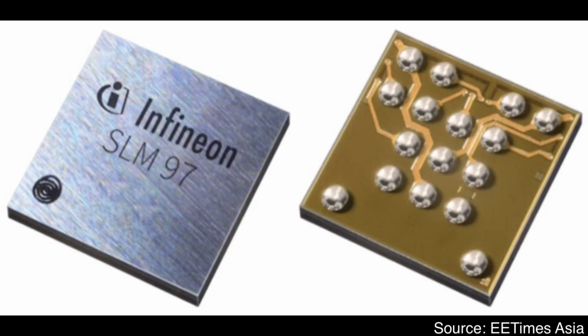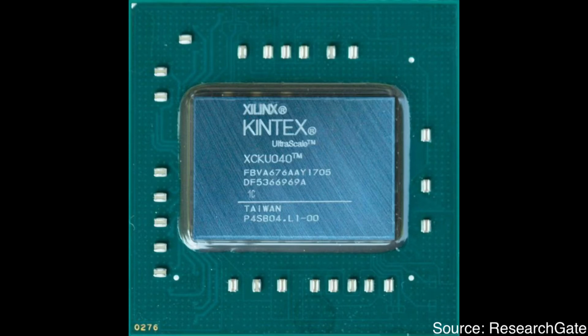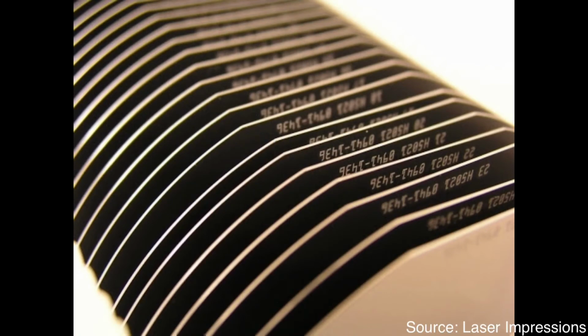In this case, Nd-YAG laser with 1064 nanometer wavelength is the most popular. But sometimes it is on die backside like wafer level CSP or exposed die package. In this case, laser removes a very small part of die surface by using green laser with 532 nanometer wavelength. It is also used for wafer ID as well.